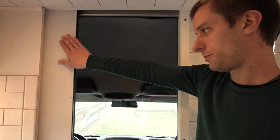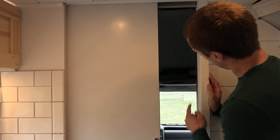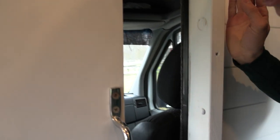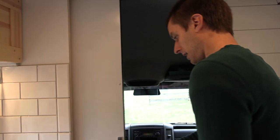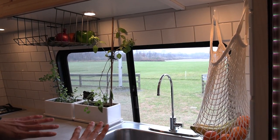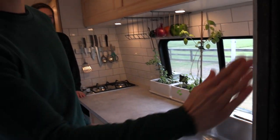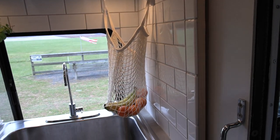This bulkhead came with the van. It has a steel frame, and I decided to take advantage of that — I countersunk some neodymium magnets along this length, and that's actually our securing system to keep the door closed. We also added a door brush to keep it sealed, separating the cold space in the cab from the warm space in the living area. Over here, I built a structure out of three-quarter inch plywood — the same plywood used to build the cabinet boxes — to make this door into a pocket door. It adds a nice bit of finish, with some molding at the top and a strip of nice wood on the end so you don't see the plies of the plywood.